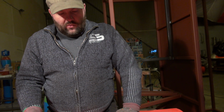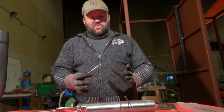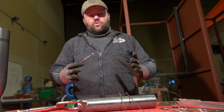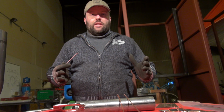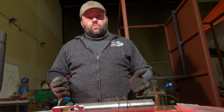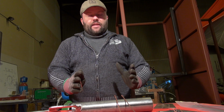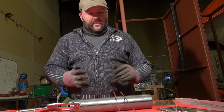The basic idea is that we're going to use a very big oven that can do the soldering in one process. So everything, the liners, the spacers, the solder material, is all going to be heated at the same rate. It will naturally expand because of the temperature increasing, but it will all do it in a uniform way. So we should be able to prevent local warping from local heating, in that the whole thing will expand and contract together when the temperature goes up and down.